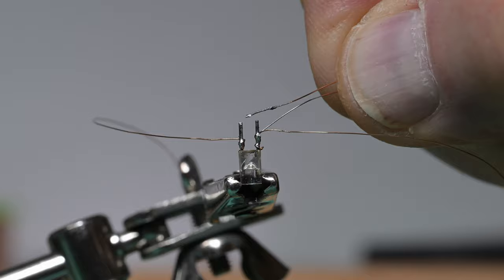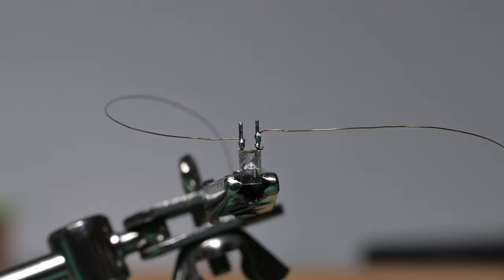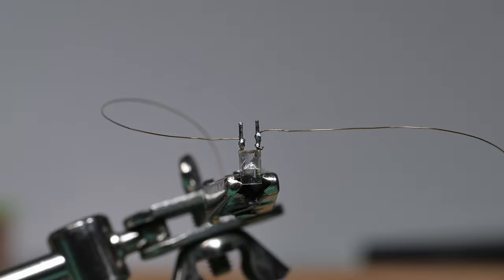That seems to work out pretty good. Now is Murphy's Law going to be for us or against us here? I'm going to touch onto the terminals - are we going to get light or not? Yeah! I'm not making a very good connection because the soldered connection is just sort of rubbing on the alligator clips, but we got it. I'm always kind of worried that the heat is going to follow through the steel pins going into the LED and ruin the delicate little mechanism in there, but they always seem to stand up pretty good. I am going to do five more like that now.